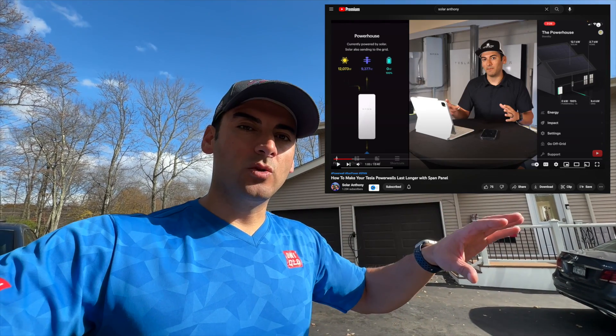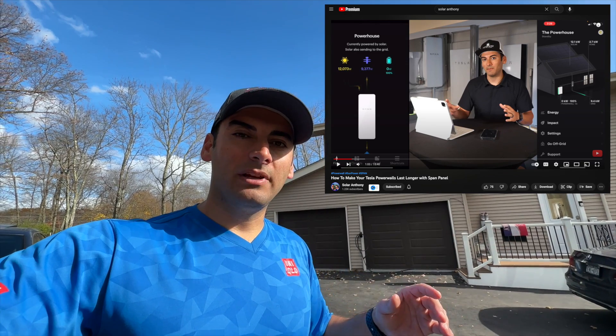Something I've been meaning to make a video about - when the main breaker shuts off and you're running off solar and battery, someone commented on my last video about the Span versus Tesla app, showing how you could make the batteries last longer. They said the solar never kicked back on in that video - you were only running off the batteries. The reason is the batteries were at 100%, so if the solar kicked on, there's nowhere for that solar to go, so it's being regulated.